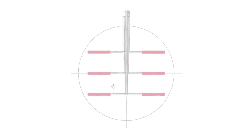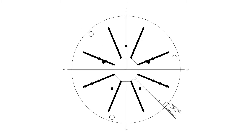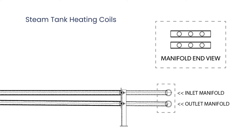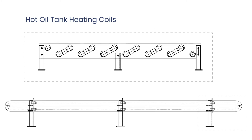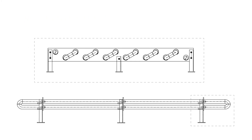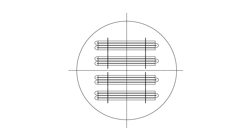If they need something more robust with a lot more BTUs needed per hour or high heating duties, we'll usually lean towards the fin coils. The coils can be designed in banks, anywhere from four to six to eight up to 14 — we just had a recent project with 14 coils in banks. We do those in steam and in hot oil. Steam coils generally have a header at the top; steam comes in, goes out through all the pipes in the coil, turns around at the U-bend, and comes back as condensate through another header.